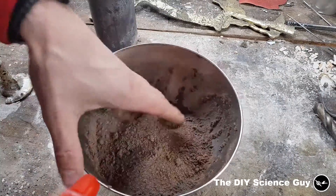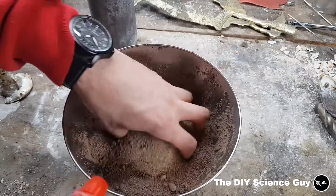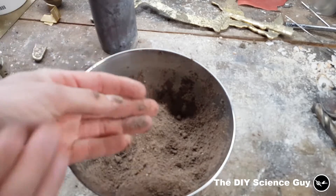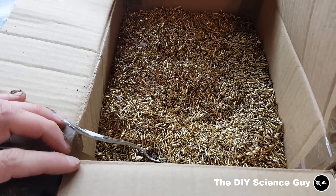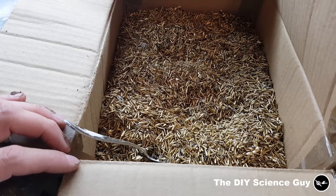So because I think the only problem I have is that I'm having slag in my casting, I need to remove that. And I'm now just going to scrape it off before I cast, because I saw someone do that. Also, I use these brass machining chips — and although it's a good source of brass, it also has a lot of surface area, so a lot of oxide will form when you heat it. So if you don't put borax in it, your molten metal and your oxide will mix together very well, and you just get a solid lump instead of molten brass. So that's why I put in the borax, which works very well. But because of that I kept using the borax — I think a little bit too much — so it really set me on the wrong path. So maybe now I find the right path, let's see.